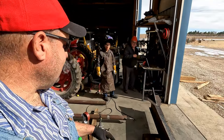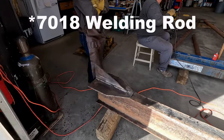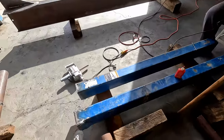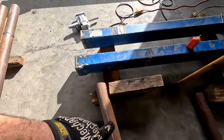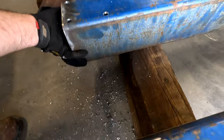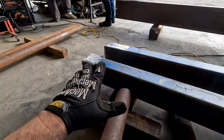I just realized something — we're going to need a gantry crane to put this gantry crane together. Yeah, but we got one right there. That looks really good — nice welds. Dad and I are finishing up drilling holes to put the casters in here. We're not going to put the casters on yet, but we want to drill the holes before we bolt and weld everything together. We've got all our holes drilled, so we're going to flip this over.